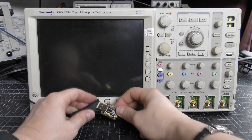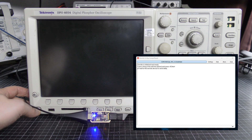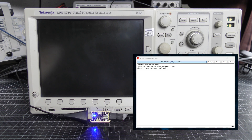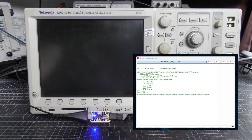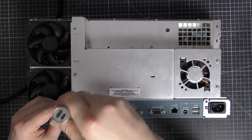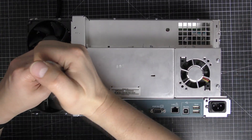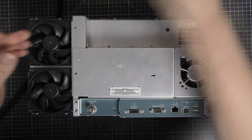Now let's switch the oscilloscope on and see what will happen. So here's our U-boot 1.1.4 — CPU test is OK, board test is OK, I2C ready, DRAM 128 MB, Flash 64.25 MB. It seems like a SDRAM problem. It's a common issue of these oscilloscopes.